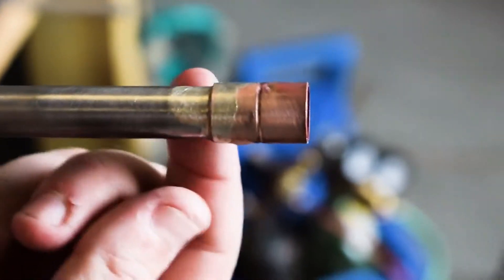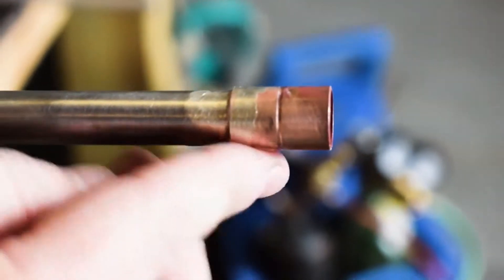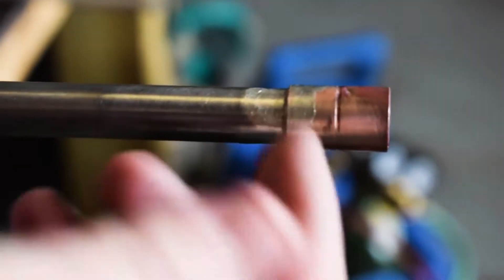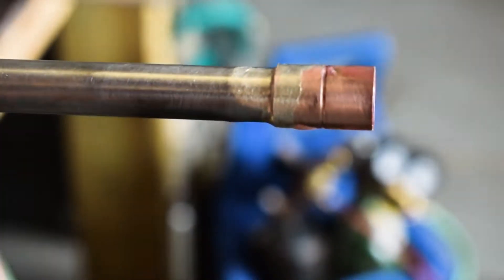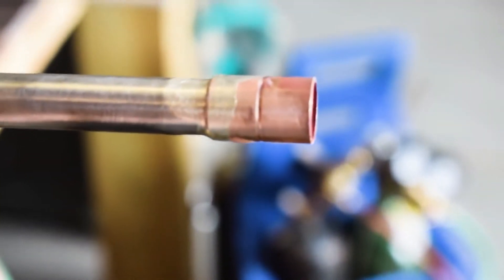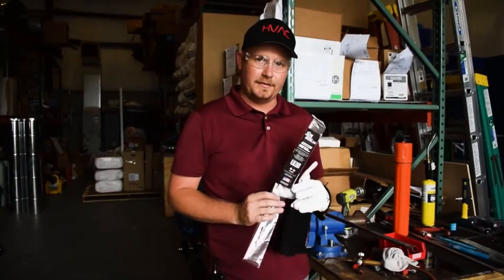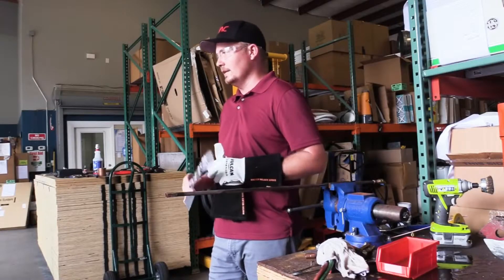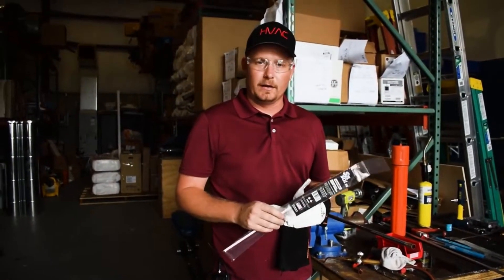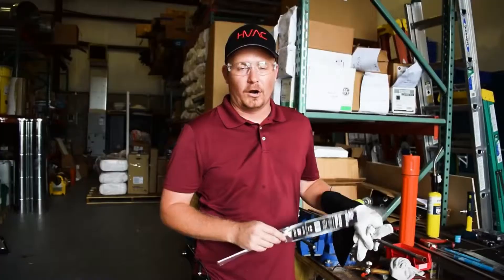If you look around the back edge of this joint, it's perfectly sealed, and we also saw the solder flow into the joint on the other side — exactly what we're looking for. That is a copper-to-steel connection: heat applied on the steel until the copper turned to that dark cherry red, then apply the rod, let the flux flow, and it makes a beautiful joint. We've been flowing nitrogen this whole time so there's no oxide buildup on the inside of the tubing. You should have a couple of these SilSol 56 rods on every truck — you can do copper to steel, brass to steel, brass to copper, copper to copper, steel to steel, or brass to brass. Thanks for watching!